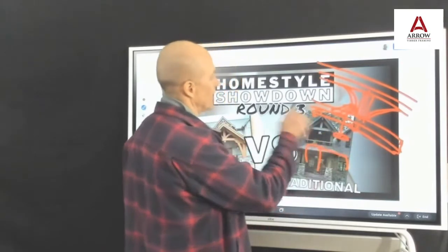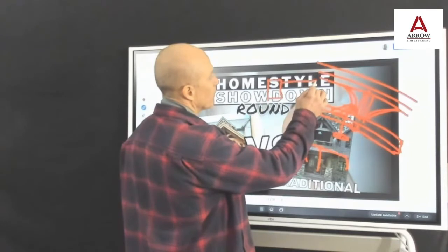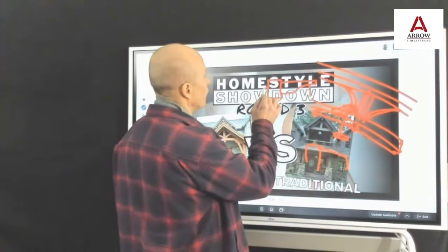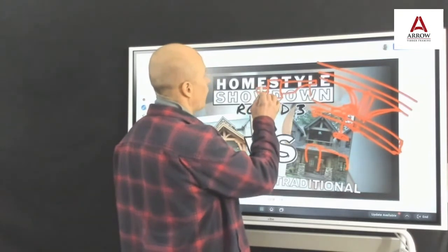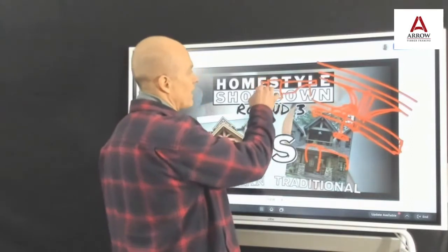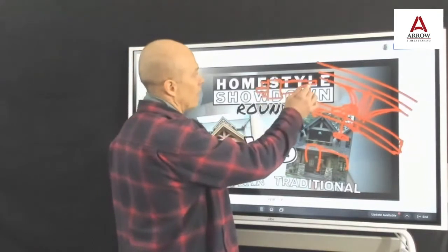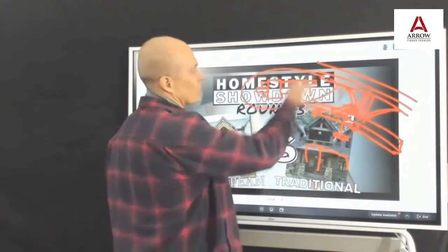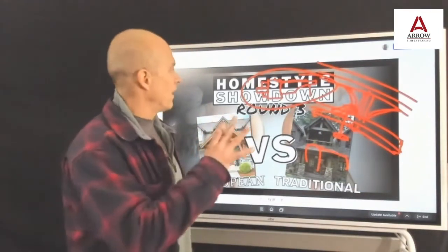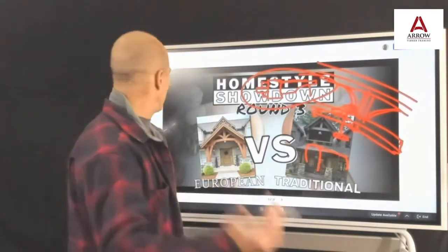And on the back side, if we're looking at a cross section of that bottom cord, this was the pendant or the support for the light. And there's a through tenon that came through, and then the wedge. So a big hole in that tenon, a wedge, just tighten that up, and any shrinkage in time, you could tighten that. And we had a lighting channel in the top. But this just screams Euro style. That's one of the things that I really like about Euro: working in those details and a lot of that old joinery and techniques that way.